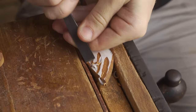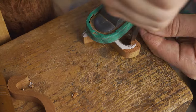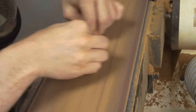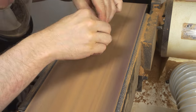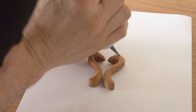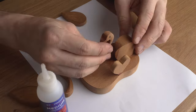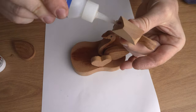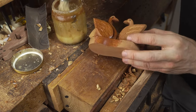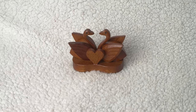We can also refine and add extra detail to the neck and head of the swan. This can further be refined on the belt sander, removing any paper and shaping, and then we can add a little bit more detail using our black Starbond CA glue and the accelerant. Once more the Starbond CA glue comes in useful for sticking the entire ornament together. The shellac sanding sealer is our finish of choice, bringing out the beautiful colour of the mahogany that we've made our swan ornament in.